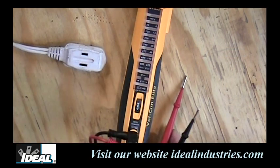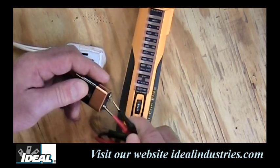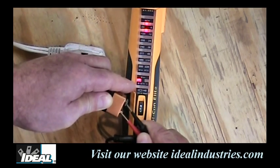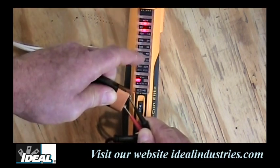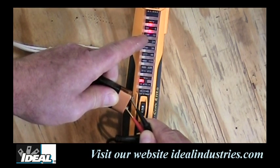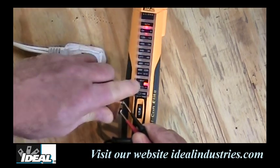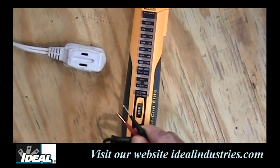To measure DC, bring in a battery and go across it with the test leads. The tester gives a positive V with straight lines indicating DC voltage with correct polarity on the test leads. On the top of the tester, the DC readings on the right side go from 6 to 220 volts — it's indicating between 6 and 12, which is correct for a 9-volt battery. If you reverse the leads, you get the same reading but the other polarity light illuminates indicating negative DC polarity.